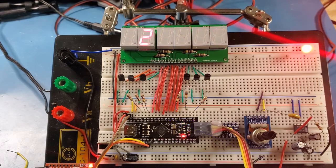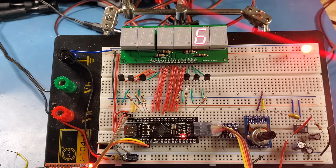Some things I'm probably not going to get to: you can compute the time zone from your latitude and longitude. There are databases out there but they're somewhat large — probably too large to put on the STM32F4. There are APIs available so if this were connected wirelessly to the internet it could look at databases online, but if it's connected to the internet it can just use NTP for time — we don't need GPS. The other complexity is computing whether you're in daylight saving time or not, and I probably won't get to that either.